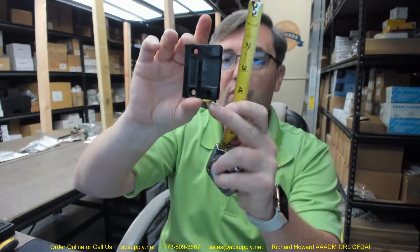This is going to come with a full lip strike. All of the exposed parts are certainly made of solid cast brass. This full lip strike is going to be 2.25 inches tall. I wouldn't call this a full lip strike in the sense of resembling a strike on a passage set or keyed lock, but a full lip strike in the sense that the lip is continuous with the front end — versus how it would be on a T strike or an ANSI strike.